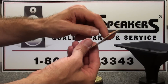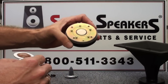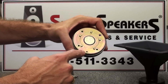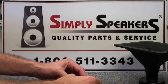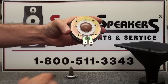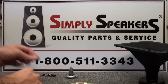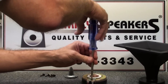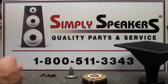Take a look at the new diaphragm and make sure everything looks good — it's round and in good shape. You'll see the four screw mounts for the lens and the one screw that holds the diaphragm in, so it really only fits in one way. We basically just come in place, snap this down within the five pins just like that. Then install the mounting screw for the diaphragm — tighten until snug, give it about a quarter turn, and you're good.